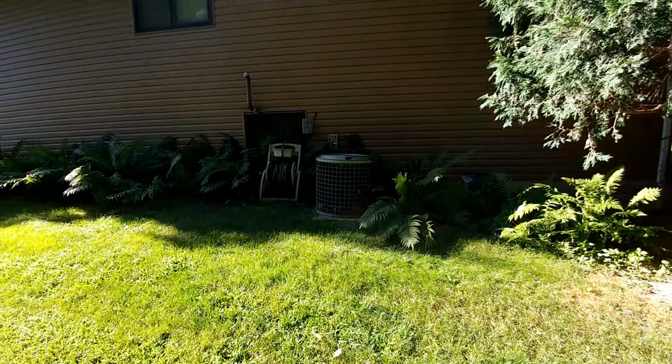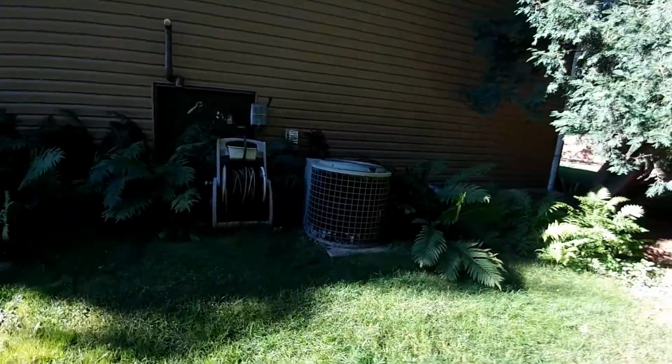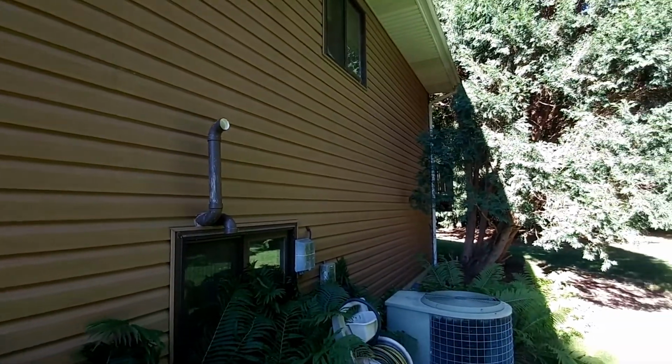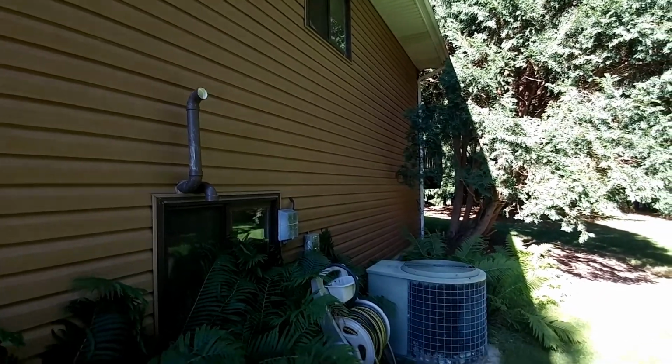Furnace and air change out here. We're taking out, I don't know what this is, I can't read it, but we're putting in a 2-ton. And it's an 80,000 BTU, 90% in there now that we're getting rid of. Putting in a 60,000.